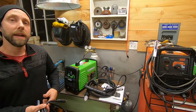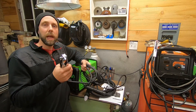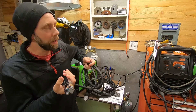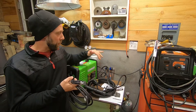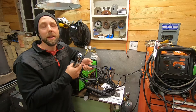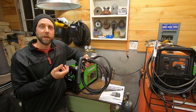The ground clamp - they're pretty generous, gave you 10 feet. It's running the smaller DIN plug, same as the Titanium 200, which is nice. One thing I thought they could have upgraded a little is the ground clamp - it's probably completely adequate but it doesn't have copper contacts on the tip. It's got copper strand in between but the contact itself is just metal.